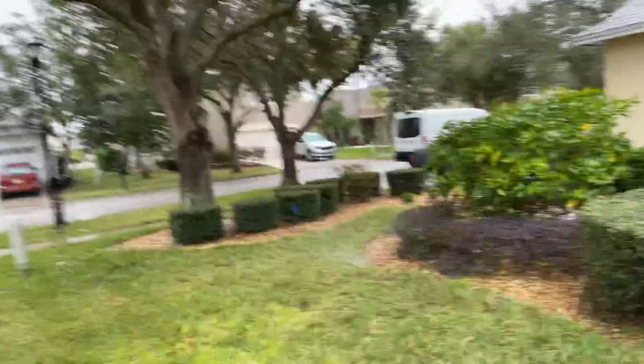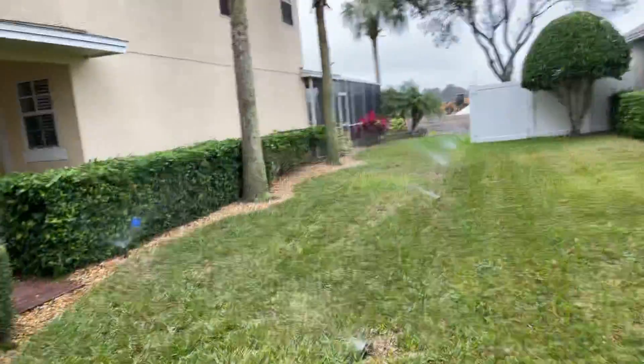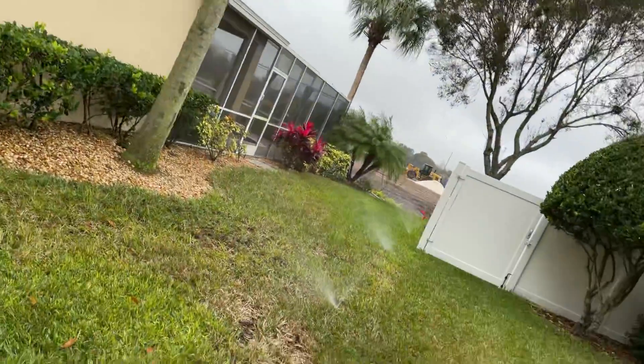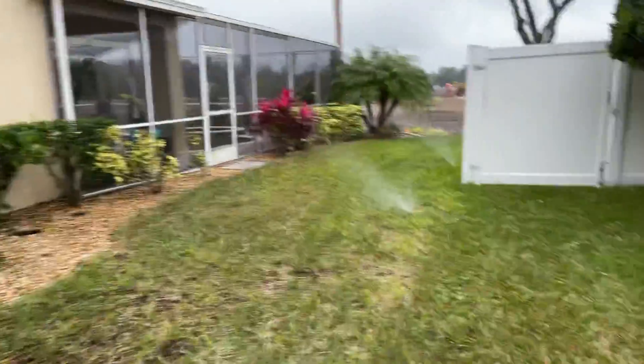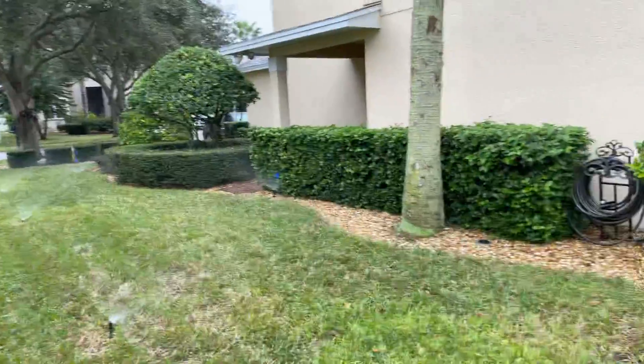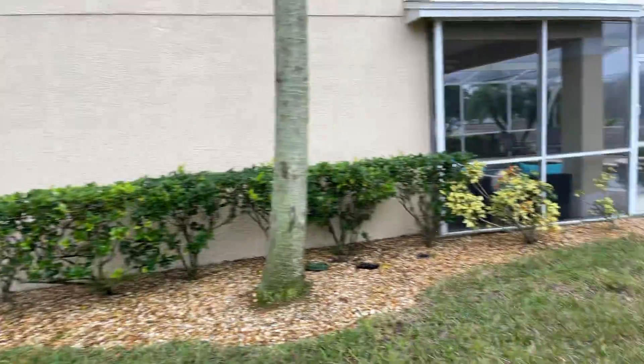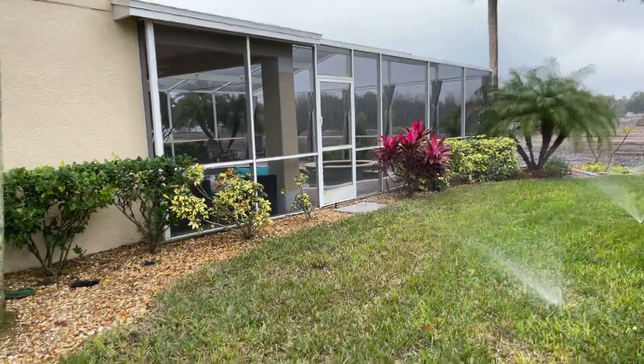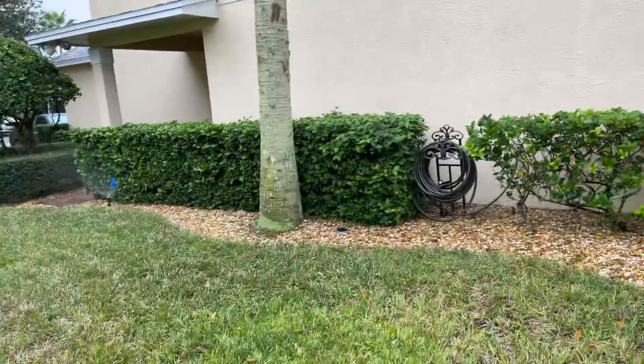Let me verify everything in the front. That's another redundant sprinkler — really useless. So for zone four, we can cap off one, two, three, and four. Those red flags where sprinklers aren't coming up — capping the excess sprinklers is going to increase the pressure and bring those up. We've actually optimized the system by doing this. We try to limit changes gradually so we can build up to a good, efficient system. This really saves you a lot of money by improving your pattern and eliminating redundant sprinklers.